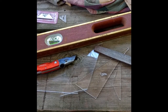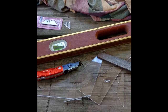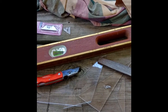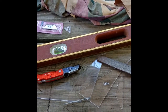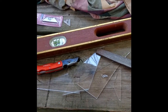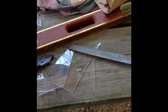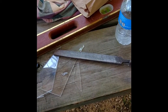The lesson learned here is to make sure you've got a sharp knife — buy new blades — and to score the plexiglass heavily so that it will break where you want it to. The other thing is I just used simple hand tools so that anybody can do this: just a utility blade and a fine file.